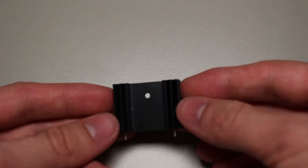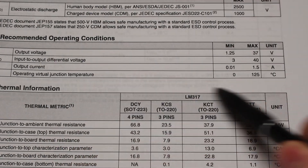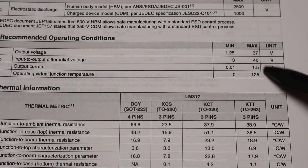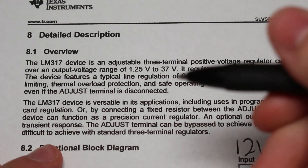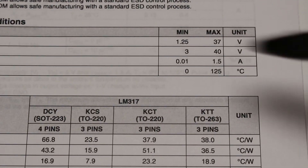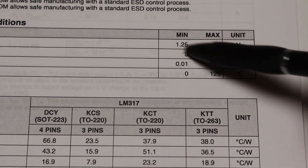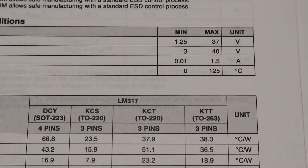You'll have to manage your heat sink and load carefully because the recommended operating temperature for the LM317 is 0 to 125 degrees Celsius. Another disadvantage is that the minimum output voltage is 1.25 volts because of the offset, and the datasheet recommends a minimum of at least 3 volts drop across the entire regulator. Fortunately, heat dissipation is just about its only real main disadvantage.